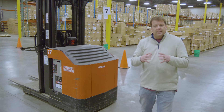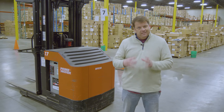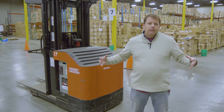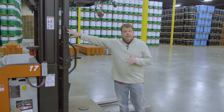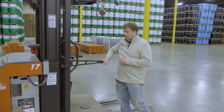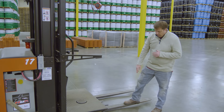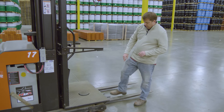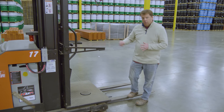It takes a little bit of getting used to driving with the wheel behind you. This machine has a single wheel in the rear — typically there's either a three-wheel or four-wheel model. Three wheels are centered and have a tighter turning radius, whereas four wheels give a wider stance but can't typically steer as tight. With the cherry picker, typically there are two arms on each side — these are safety features. Basically the machine won't run with these up, so you want to have those down. Your forks are fixed — they don't pitch like a typical forklift. They remain flat. And then you'll see a grabber in the center that actually locks onto the center of the pallet.